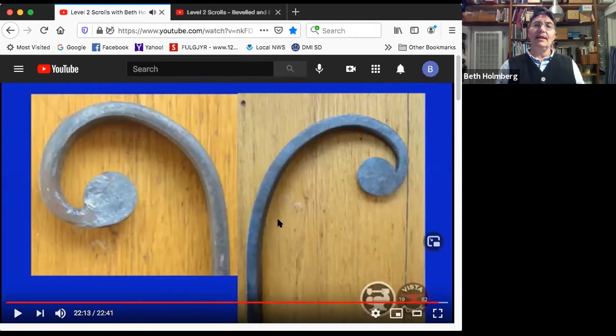So a little bit of good and bad here. It's really nice if that beautiful line you've got in that center comes around, circle, circle, circle, and then it starts the scroll. The scroll starts right from that into the bend of the scroll. That was that work we did on getting this bar tapered in, the transition smoothed in. At the same time, we got this nice little eagle's beak back here so that it would look really nice. Scrolling, no kinks, no flat spots. The negative space expands the whole time.